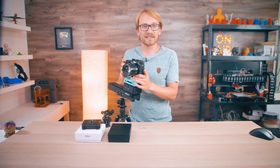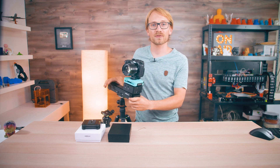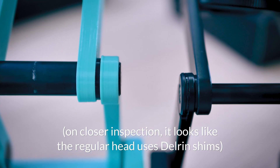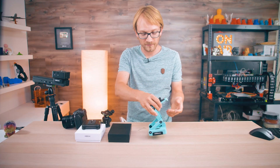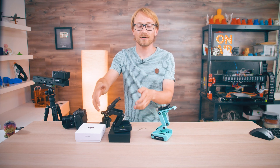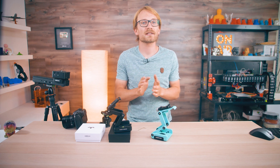It holds up the camera now, but it still feels a bit stiff. These things are probably something that can be solved relatively easily. I've already suggested to Edelkrone to maybe just use two shims per joint so that you'd get the rubbing action between two pieces of aluminum — like in the regular head — rather than PLA rubbing against aluminum. But maybe even just using nylon or Teflon washers would help a lot already. Also, I feel like the exact filament you use has a massive influence on how smooth the action is going to be. A PLA with a bit less of that glossy and squeaky surface may give much better controllability, or maybe if you use something entirely different like carbon-fiber-reinforced nylon, it may actually be a totally different experience.